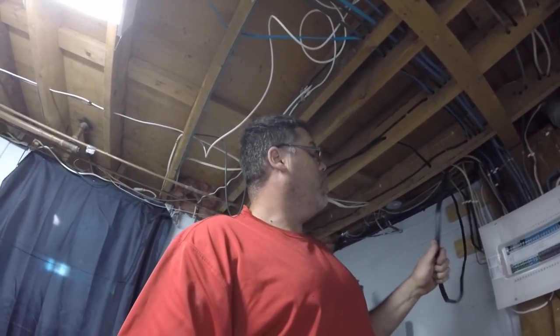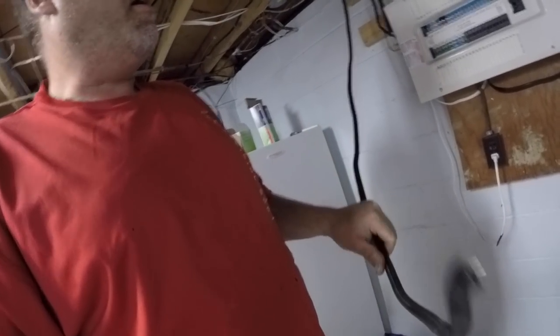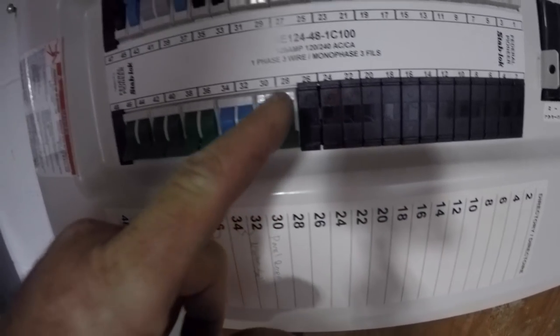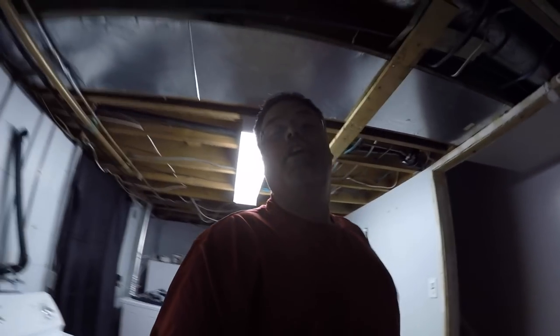But just so you all know, eh, I had a lot of comments about the old cable, boys. There she is right there. 10-gauge, 30-amp wire, boys. There's a breaker that's going outside to the front garage for the trailer. 30-amp, single pole, 10-gauge wire up to the plug, boys. For all of you that are wondering and worried about my wire size not being big enough, just ask my wife. She'll tell you. Friggin' right, she will. But anyways, we're good to go, boys.